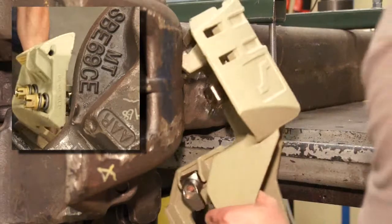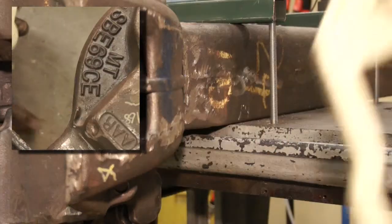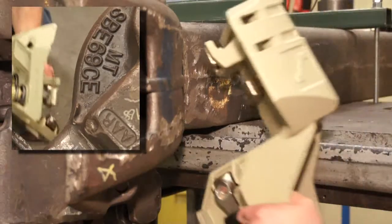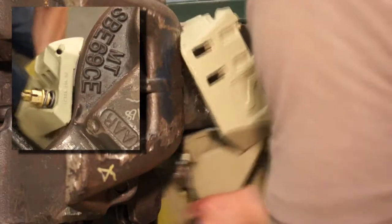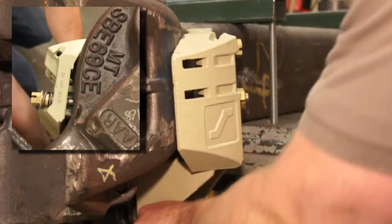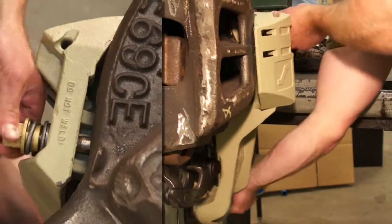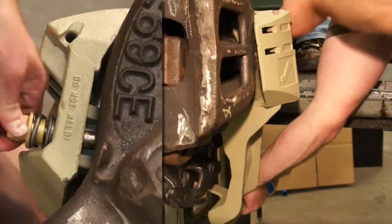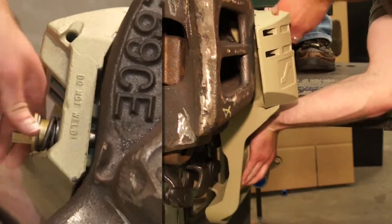To install the CMB, insert the bracket on an angle so that the top clamp will slide under the top edge of the lightener hole, and the bracket's resting shelf sits on the horizontal rib of the coupler. Make sure that the bottom clamp is in the bottom lightener hole. Hand tighten the top spring retainer assembly a few turns to reduce slack between the coupler and the bracket.